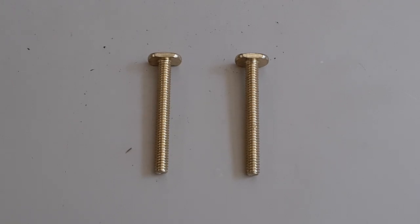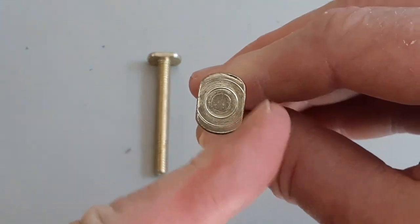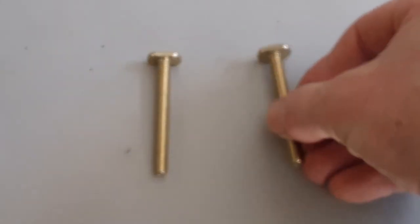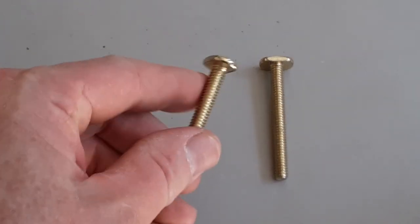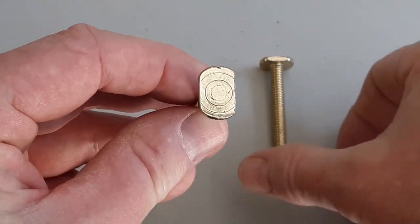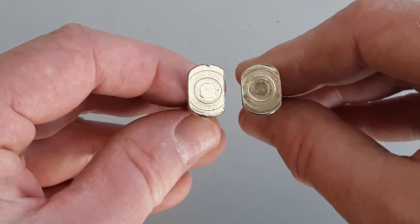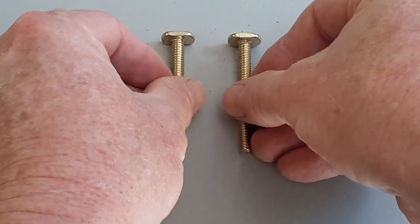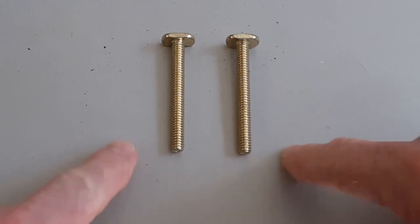I have my two brass T-bolts and because brass is soft, they're going to be easy to file down or grind to fit in your sport track or whatever track you have on your boat. This is what it's going to initially look like — it's got two flats on either side. I've already ground one down to show you the difference. I ground down one side so you can actually load it into your sport track. I did it with a file in a vise. Then once you decide what length you need, you'll just cut those off with a hacksaw.